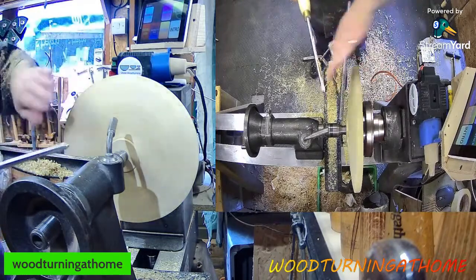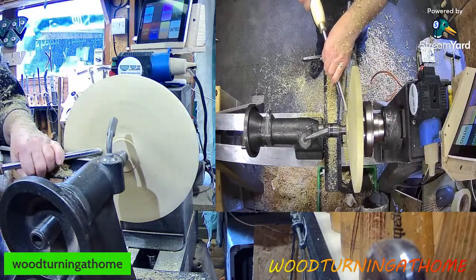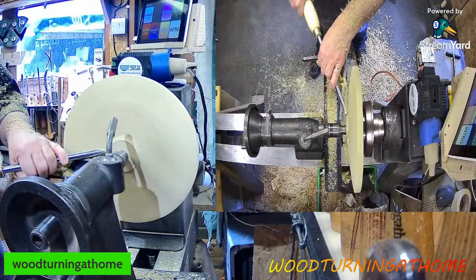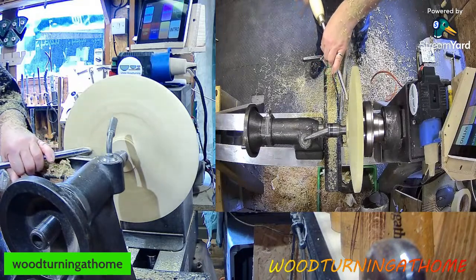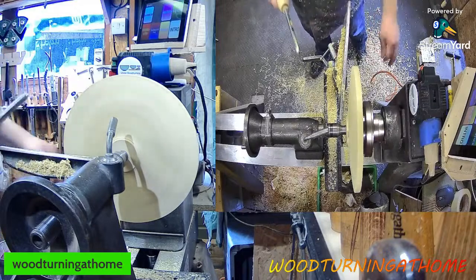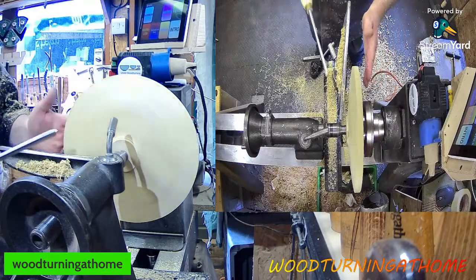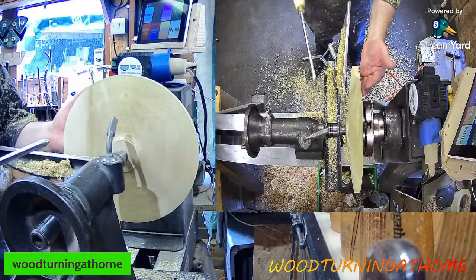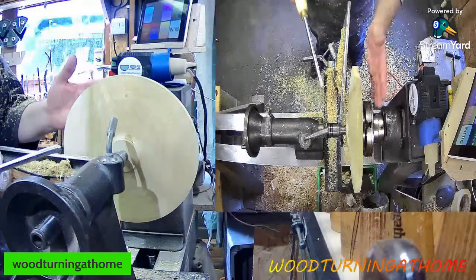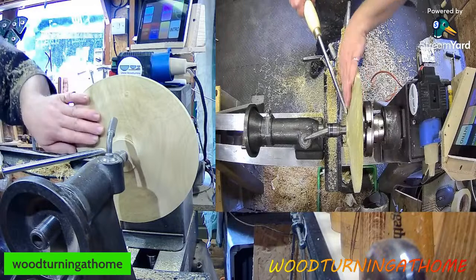We're just bringing this down gradually. Obviously, we don't want it too deep at the back. Paul, did you leave the front side totally flat, or is it slightly curved? Yeah, that's what I was saying, Doug. If you were going to paint, you could curve this in the front, so it's running in at an angle in the face of it. I chose to leave it just flat and take all the timber away from this side.